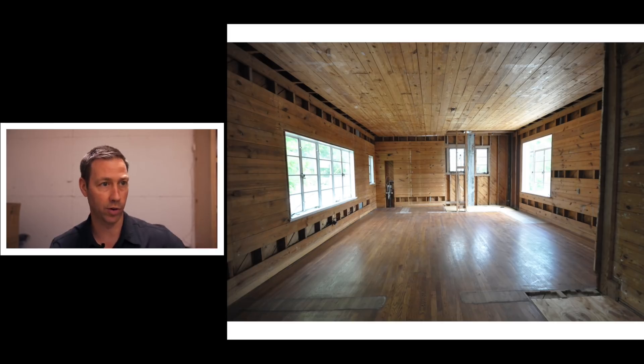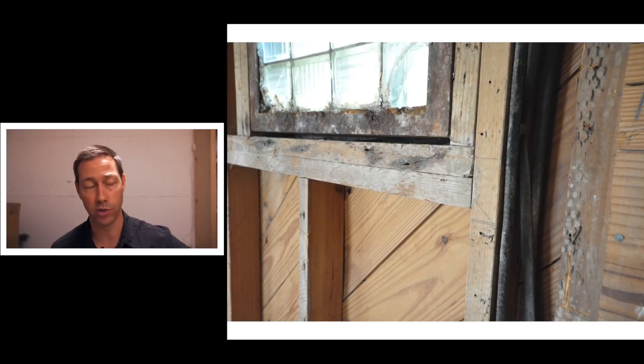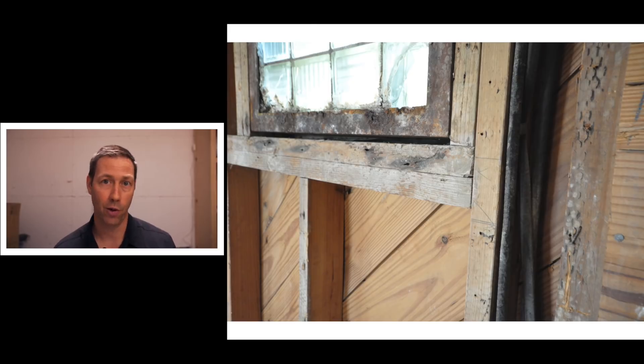I love this shot. You can kind of see this big living room section on the house — hardwood floors, and everything else you're seeing in the photo is all pine. Now let's take a closer look at one of the windows. Those steel windows were rusted out pretty good — they really hadn't been maintained or painted in a long time. But look at that 2x4 sill underneath that window. You're seeing a little bit of black staining, especially around where the nails were. That's where water had probably gotten through the window and stained that bottom sill. But what's absent is there's no rot. There's really no mold to speak of. That window leaked, but the solid 2x4s were able to absorb that water. There was no insulation in there, so there was probably a fair amount of airflow, and certainly plenty of heat flow through this building as well.